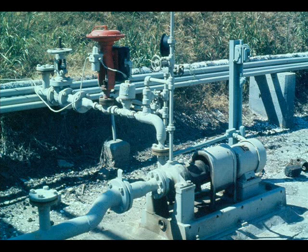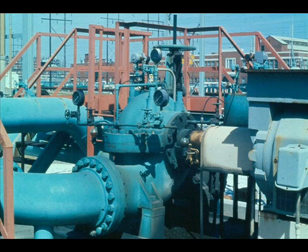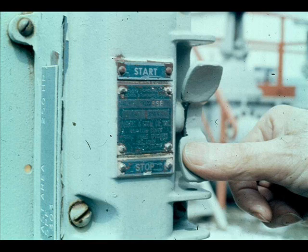Shut off steam tracing. Your unit procedures and your own good judgment may change some items in these procedures. Some pumps must always be ready for immediate startup — including pumps on automatic control and some spare pumps. A good rule is: don't do anything on shutdown that would interfere with immediate startup. In some such cases, you just stop the driver — nothing more. Open workbook number two now and complete the exercise.